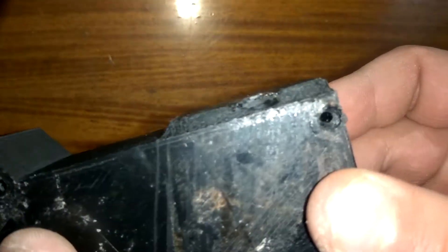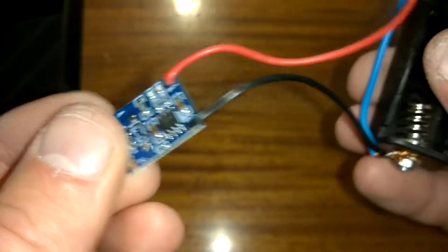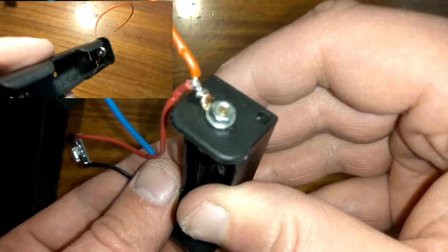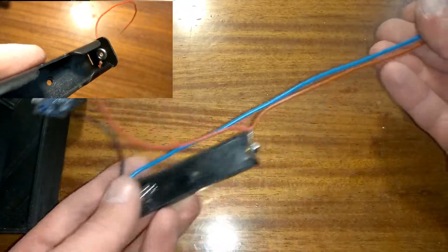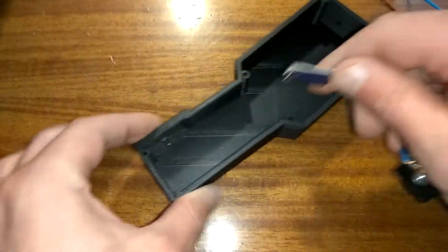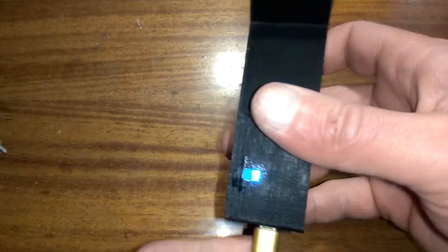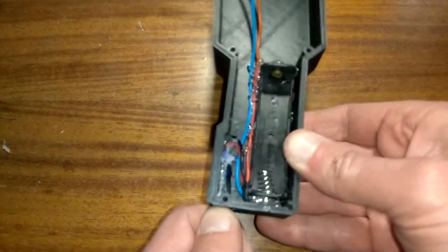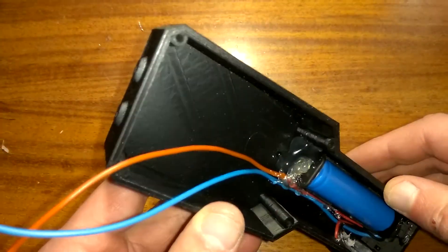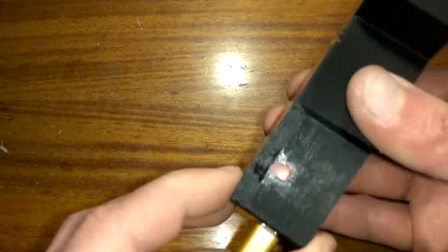Now, it's time to add the charging module. I will use the variant without protection, because this device will draw more than 2 amps from the battery. I had to beef up this battery holder, because the original holder is not designed for high current, and since it's an old laptop battery, in future I will need to replace this battery. The blue LED lights up on the charging module when there is no battery or it is charged. The red LED lights up when the battery is charging.